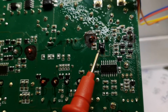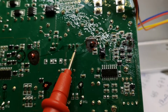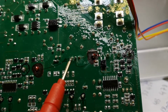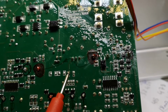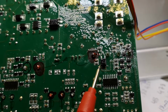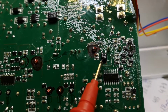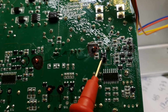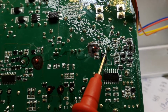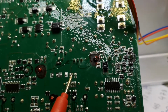And this can also explain, because I think they're driving this optocoupler way too hard to trigger the Triac, why these seem to be working, but they get weaker and weaker until they fail to drive the motors. Of course, if you're driving the optocoupler and the Triac too much, the lifetime of your optocoupler will be very, very short. So it just gets weaker and weaker, and that means the timing for the Triac gets shorter and shorter, and suddenly you don't have enough voltage to maintain your motor power.